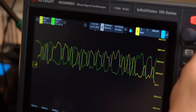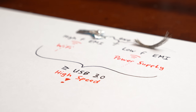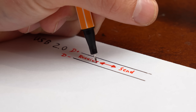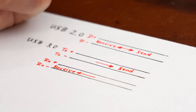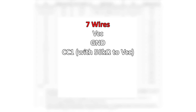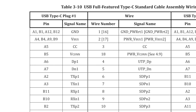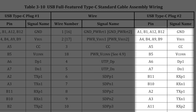After checking the signals on the oscilloscope, shielding seems to be really important and should not be forgotten. So are we ready for high-speed USB? To achieve that, USB moved from one differential channel used for both sending and receiving to two differential data channels — one for sending and one for receiving. According to the official USB documentation we need a total of 7 wires: two for power, one for CC (the configuration channel), and four for one data channel. The documentation also tells me exactly what pin on one side has to connect to what pin on the other side.